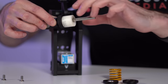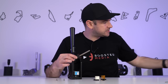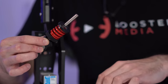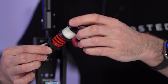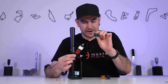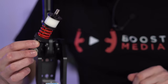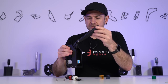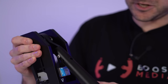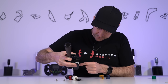With the assembly out, you can see the spring perch on the bottom — a nice anodized CNC machined piece of aluminium. The metal spring sits in the stack; the weaker spring always compresses first. There's another spring locator and then the elastomer on top. You can swap in the blue spring or the red spring — the stiffest — in place of the yellow one. The Pro Kit also includes a harder elastomer if the white one feels too squishy. Just be careful not to knock the lever while working on a mounted handbrake, as it will free fall.